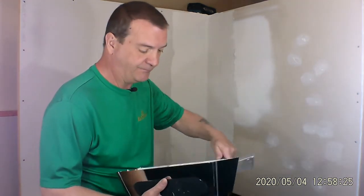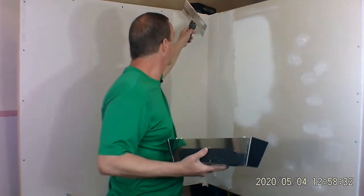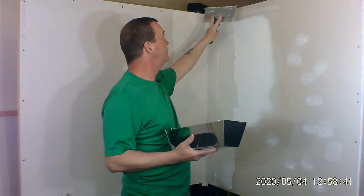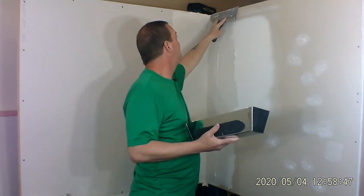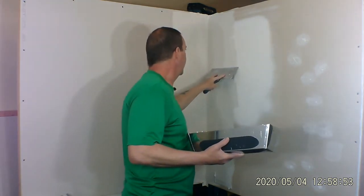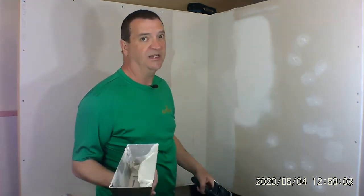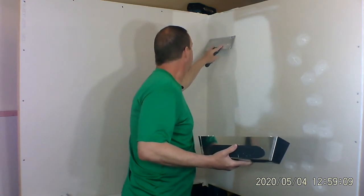All right? So back to the 8-inch knife, and what we're going to do here is we're going to feather this out now from here out. So again, same technique, two fingers. I'm on this side of it, so I'm going to use more pressure on the right finger and let the left finger ride. And I'm going to feather that edge out. Just like that. Look at that. Feather the edge right out. Because we want to sand as little as possible. We're going to go down one more time. Feather that edge out.